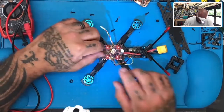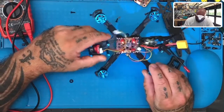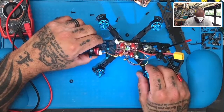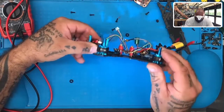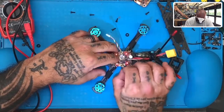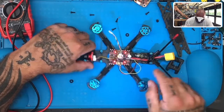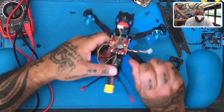It does not have a warranty, sir, on something like this. I'm just looking at it. I mean, it's got grass marks all throughout it, so this thing has been flown. The fact that the grass is stuck like that tells me that it was wet. And I understand the gentleman's built drones before, but nobody would wire a drone like this, where you have the wires coming from the outside. The only other thing is you can see where the capacitor has been cooked.